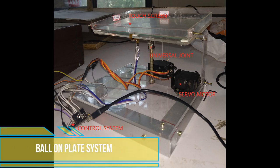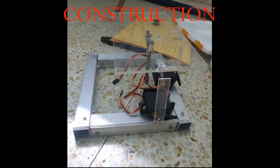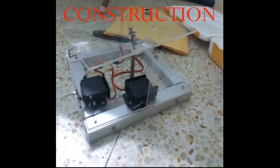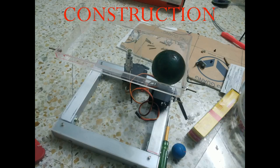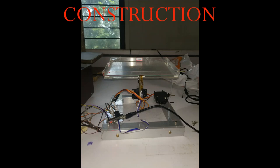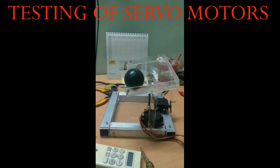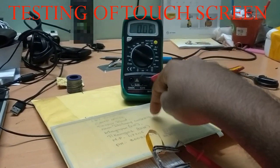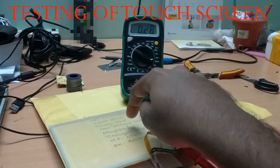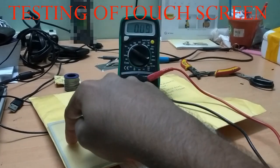These are the basic components of the system. A 4-wire touchscreen is nothing but 2 potentiometers combined together. So here we use the variation in the resistance to detect the position on the plate. For a more detailed understanding of the touchscreen, see the video linked in the description.